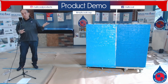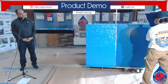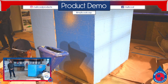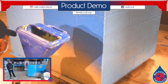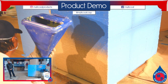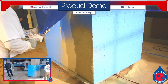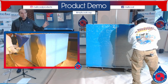So the scratch coat he's about to spray on is the same product that we use for pool replastering. We also recommend that you can roll this product, again with a 3/4 nap roller, as just a protection coat, or you could shoot it with a hopper like Alfonso's doing here. We do this system a lot on custom homes.